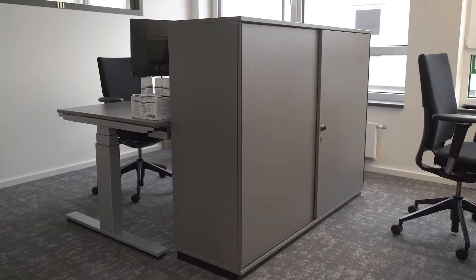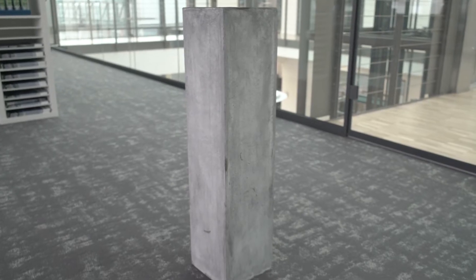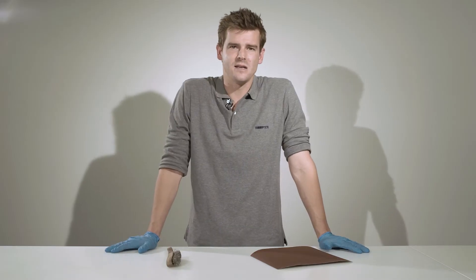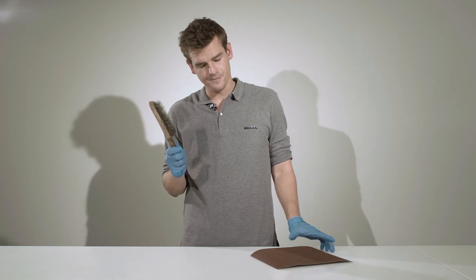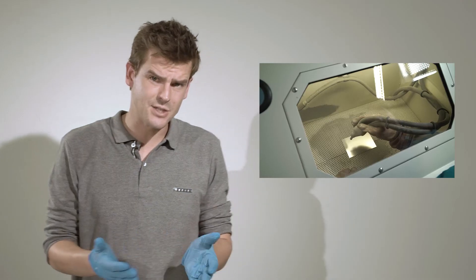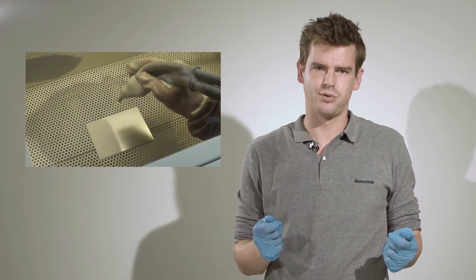There are thousands of different materials in the world that can be bonded with each other. As explained in a previous video on all-purpose glues, a rough surface is ideal for adhesive bonding — it enables mechanical interlocking of the materials. That is why roughening the surface before bonding is often very helpful. Depending on the size or the surface of the component, you can either use a wire brush or good old sandpaper. In industrial applications, the so-called sandblasting technique is often used, where materials are treated with a special abrasive combined with compressed air. After sanding, we clean again to remove the sanded-off dust particles.